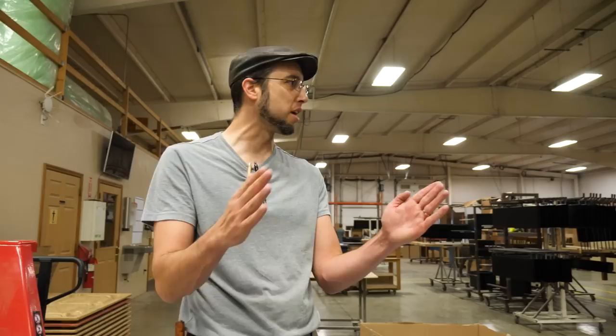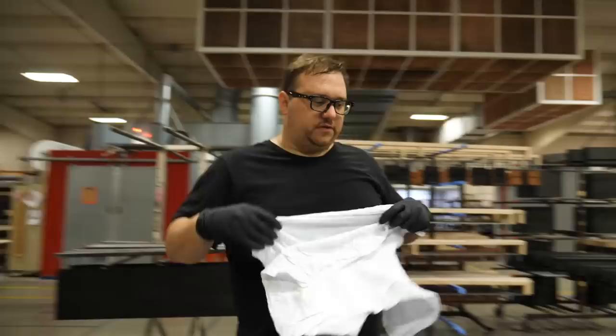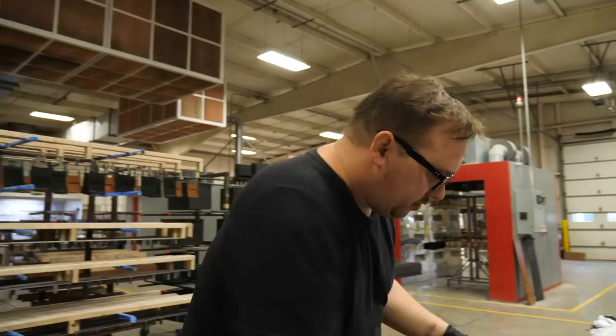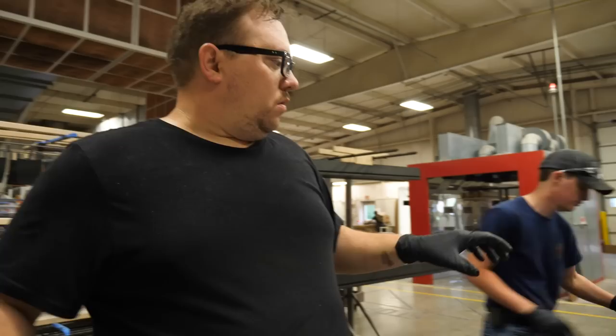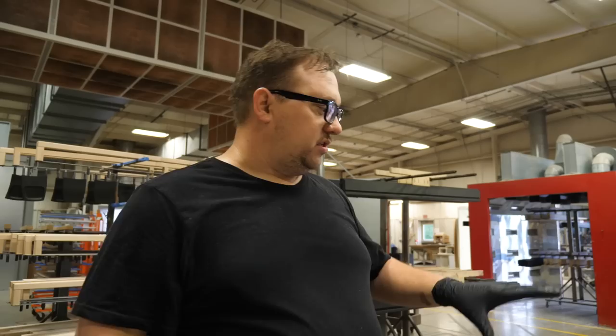And by the way, this is a modular product — they could get parts from any time period. What makes stain work in normal furniture is the fact that they get the furniture all at once, so you can make sure it's stained consistently. On a stain product, your sanding consistency is super important. All you're doing when you sand is creating an even scratch pattern — the finer the grit, the smaller the scratches. Stain picks up every single one of those scratches and basically highlights them. So it's super hard to touch up, because you can't just spot sand. Anytime we have to touch up, we basically have to freshen up the entire board.